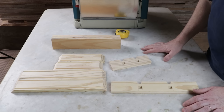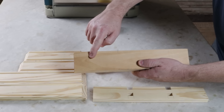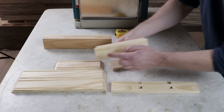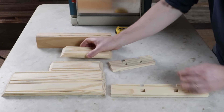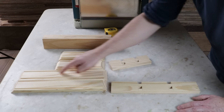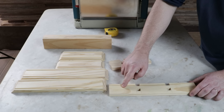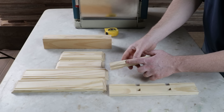Here are all the cut pieces. Now I will recap all the measurements. We have six pieces measuring 33.3 centimeters by 6.2 centimeters wide, with a thickness of 7 millimeters. Two pieces measure 21 centimeters in length from the outside, 15 millimeters thick, and 6.8 centimeters wide. Two others are also 6.8 centimeters wide but 35.5 centimeters long. Two pieces measure 2.8 centimeters wide by 32.5 centimeters long, and the smaller ones are 18 centimeters by 2.8 centimeters. All four parts are 15 millimeters thick.